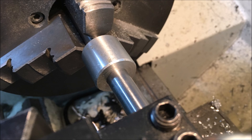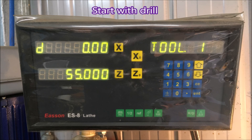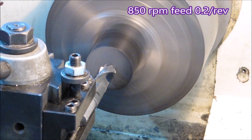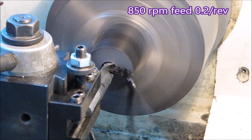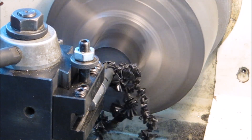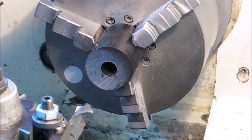There's just a couple of 12mm ground pins being used to help me find the centre and the centre height of where that 15mm drill will be going. Those settings there on the DRO are zeroed for the drill so I can put it back in the right place all the time, and the 55Z was just for the length of the turning tool that I'll be using to face off the part to 55mm long.